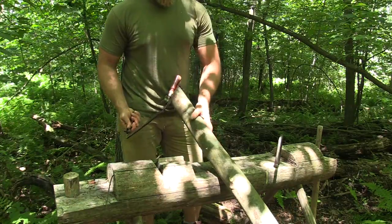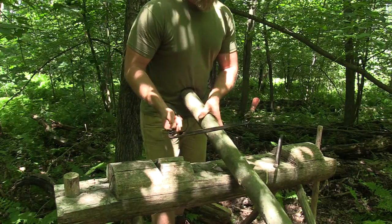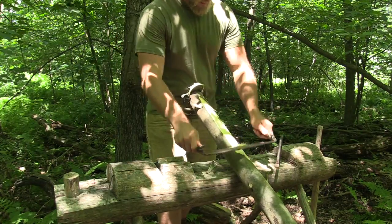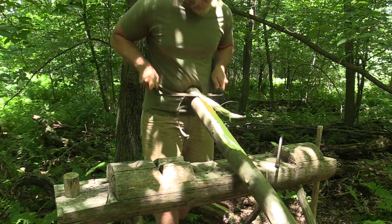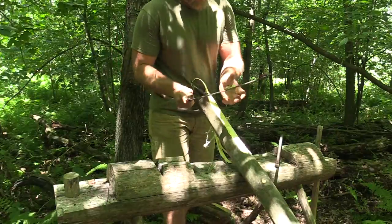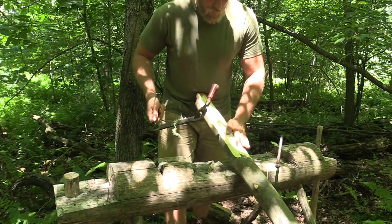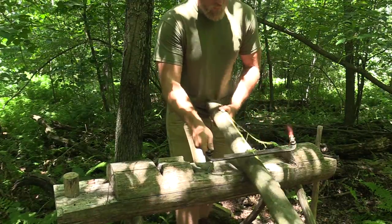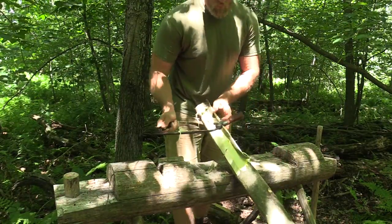Now with a little bit bigger piece of wood — this is a piece of tulip poplar that's been down for about two months — you can see this draw knife: you just stick it underneath and pull it down. Sometimes you have to clean the blade off a little bit, but that's it. Just get down in there and clean off that outer bark. With tulip poplar, you want to make sure you get that inner bark out too, to really get down just to the wood. You can see how easy it comes off — it's manageable, and you can twist and turn the piece as you work.